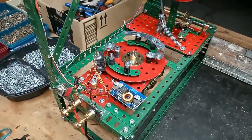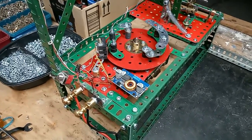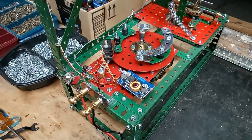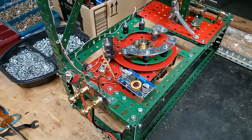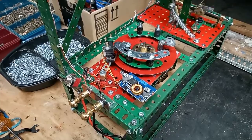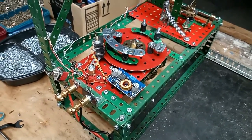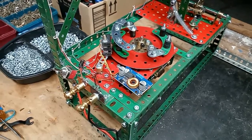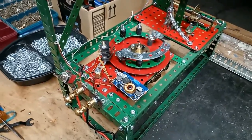This contactor controls the operation of the model. There's a stack of three micro switches. The bottom one is for the main motor that runs the cars up and down. The middle one is for the bell, and the top one is for the reversing relay. Here none of the switches are activated and we're just in pause.